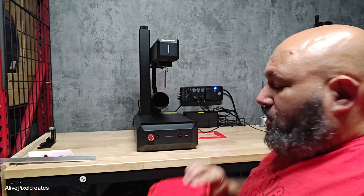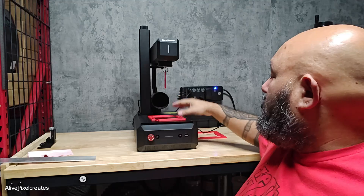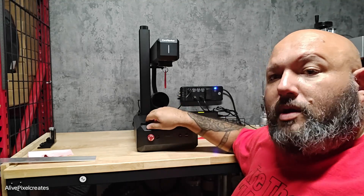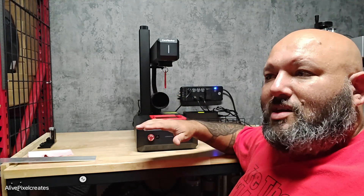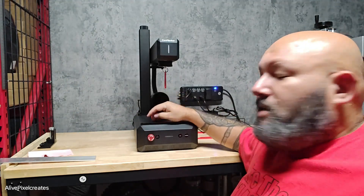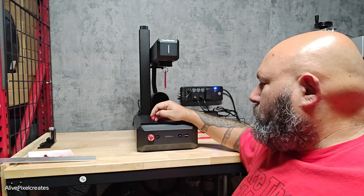I made a little fixture to put my jigs on it and I can use it. They use 25 millimeters from hole to hole on the working plate, which means you can use basically any jigs or fixtures that you can get your hands on that will fit any laser. The difference is instead of M6 screws, they are using M5 screws.